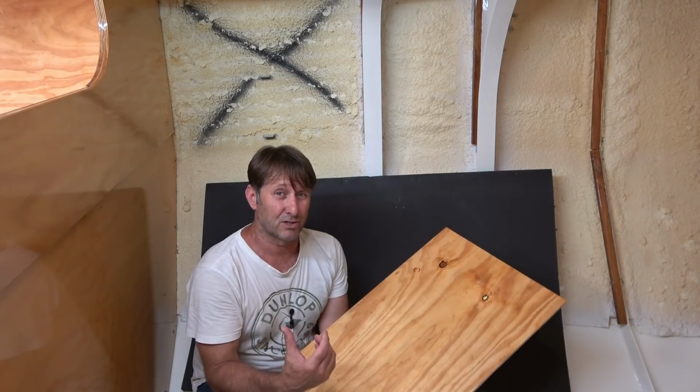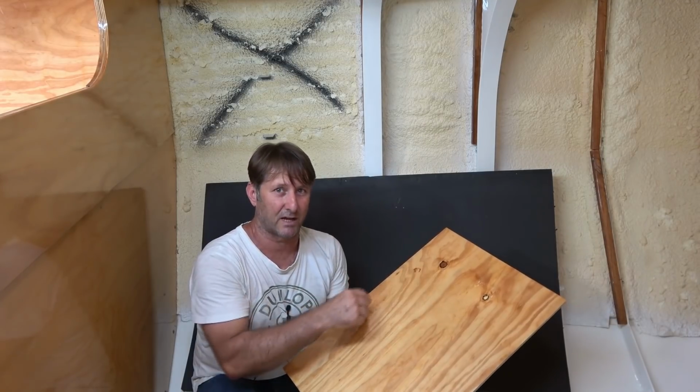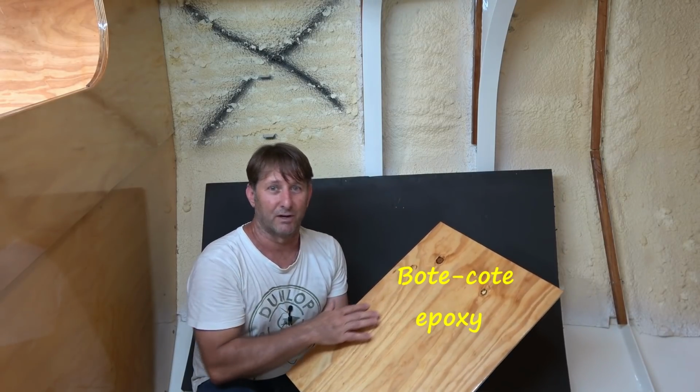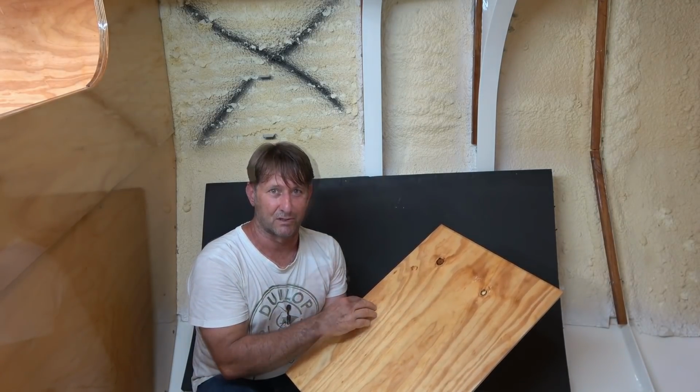And another thing, as mentioned previously, when it came to removing that panel in the galley, I chose to not sand the panels where they're going to be adhering to the battens with the Fix 15. And that was very good proof that it's the right way around, I think. The Fix 15 still adheres to this, but I think with the gloss finish of the boat coat, it's just not absolutely bonding to the surfaces. I just think that that's worked out well. In the event that these need to be removed at all, yes, a little bit of force is required and they can be removed.